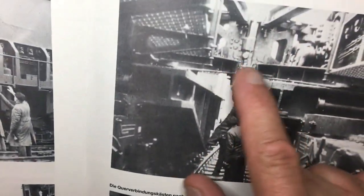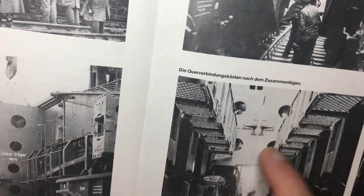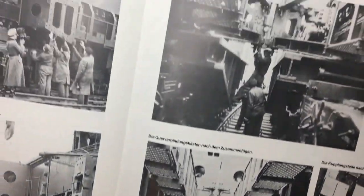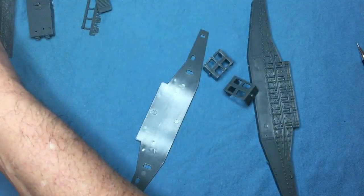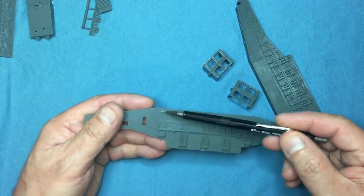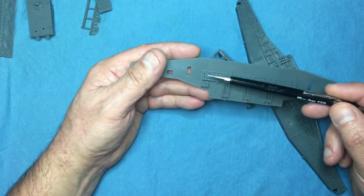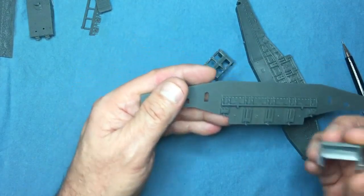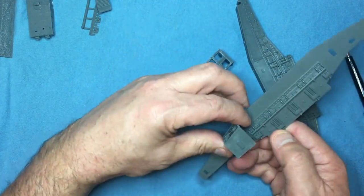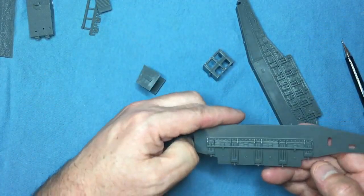You've got these two clamps, the front and back, that hold everything together. This system here holds the two sides together, and then you've got these blocks that are bolted together that hold everything. So yeah, they've made a bit of a mistake there. And of course the other thing is that the box should be here, not all the way up here. So putting these jacks the way they have, they've actually forced themselves to put this incorrect rear box placed at the front right up here, whereas it should be way back here and half the width. So there's another reason for doing something with these jacks.